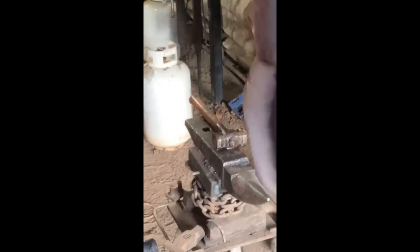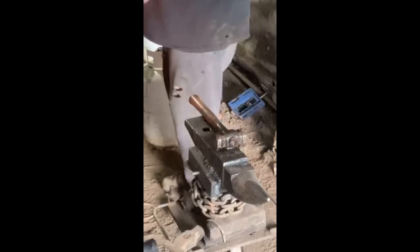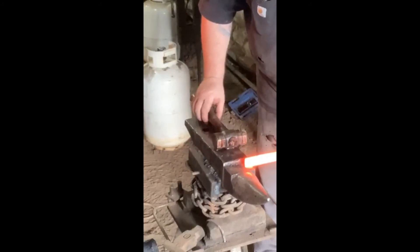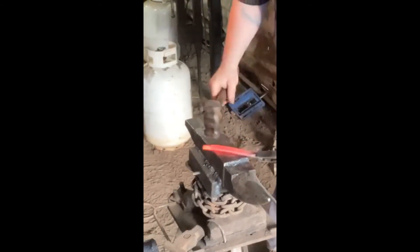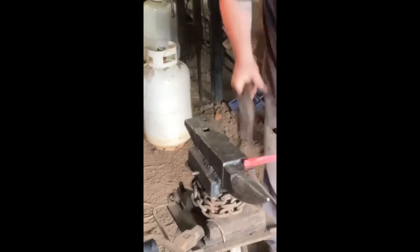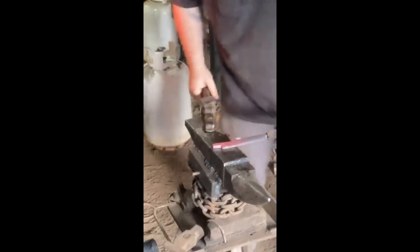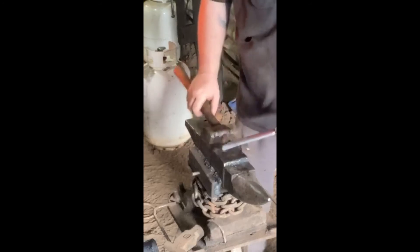We're going to wait for this to heat up to weld heat — we're not quite there yet. Two chunks of steel in there is not always a good thing. We'll just sit here until our piece is at temperature and continue working on this draw knife. I'll put a little chamfer in this, take it back to center on this one side. Starting to get a twist in it. This draw knife will lengthen out a little bit, but it's not going to be a super big draw knife — it will be a nice little one. All this is just cultivator steel.